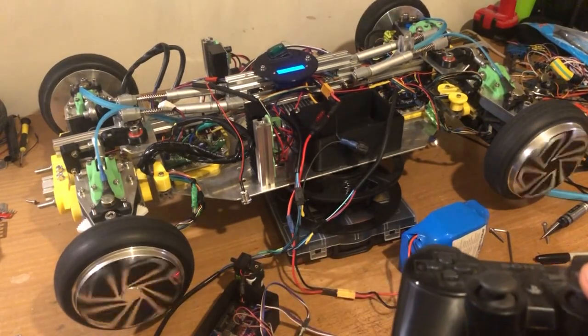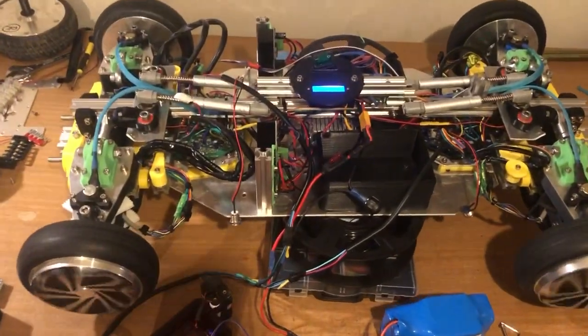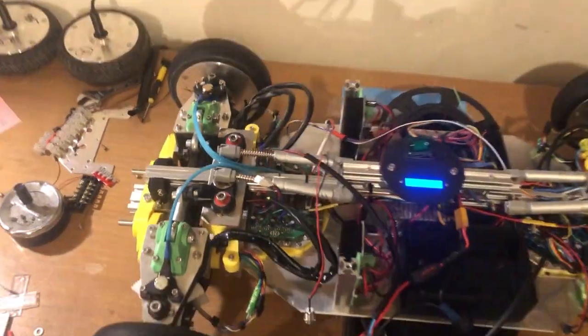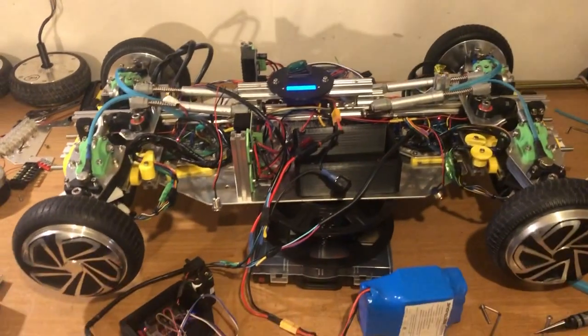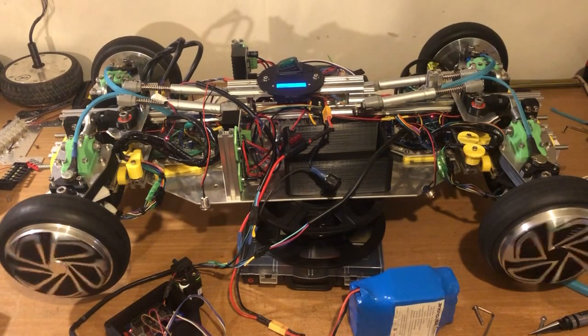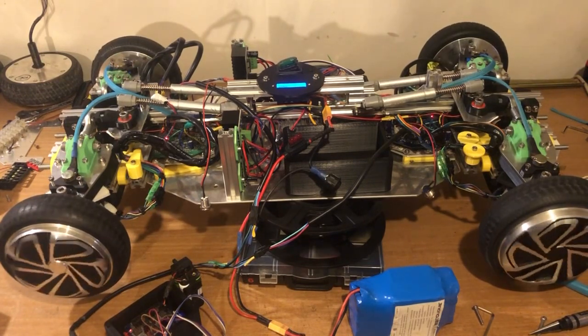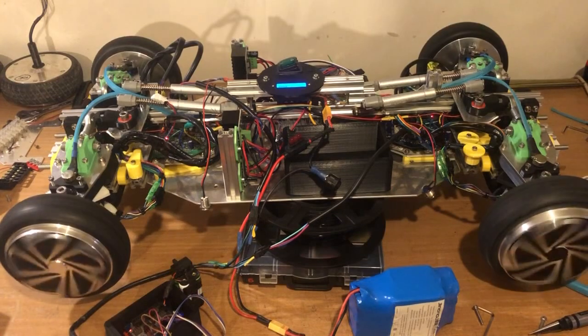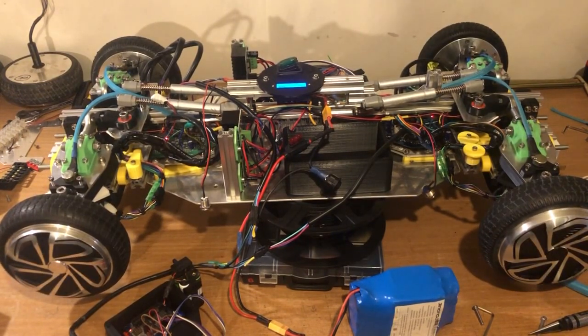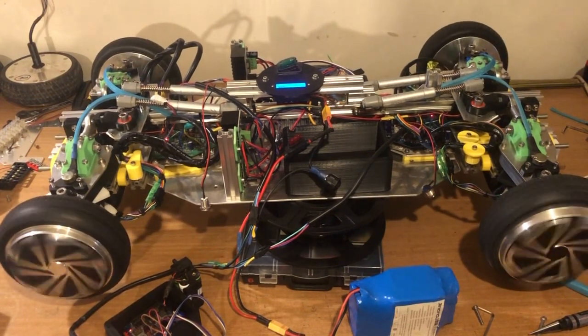This is a little bit scary. So we have got four-wheel drive. 1, 2, 3, 4. But they are all at slightly different speeds. So I think I'm going to have to set up the motor controllers differently, probably have to use 4 DACs instead of 2. But it seems alright. It's got the speed up, slow down for the steering, so that's quite handy. Whoa.